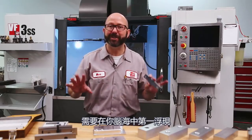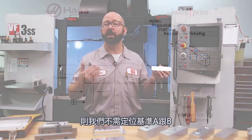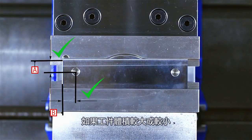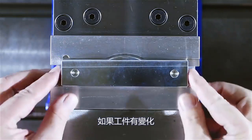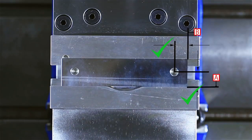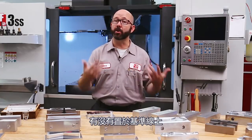This is huge — this should be foremost in your mind as you are designing any kind of fixture. If these holes have a tight positional tolerance off of datums A and B, then we should be locating off of datums A and B — off of the fixed jaw, not the floating jaw. If the overall part size varies but still stays within print, our hole positions are going to be moving around unless we locate on our datums. Have you ever spent all day moving your offsets one way or the other to keep a feature within tolerance? Ask yourself: are you locating on your datums, and are those datums being located up against a solid fixed jaw?